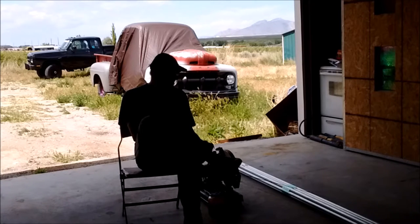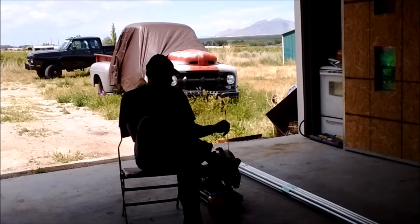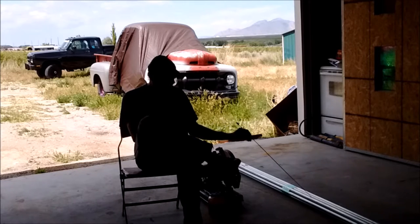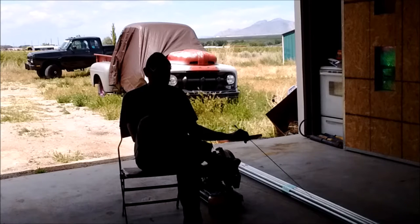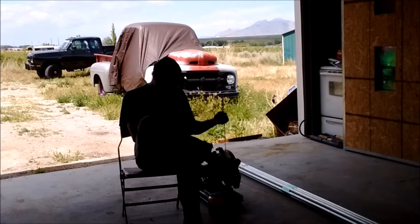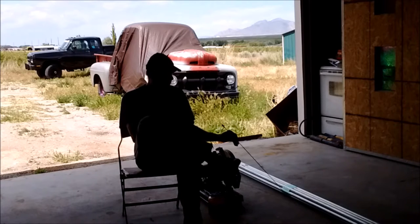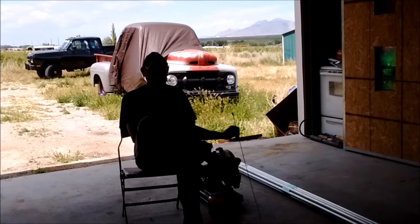We're getting ready to build our rack for the old oven here. This is 1-inch conduit, electric conduit. I paid about $70 for 10 sticks at Home Depot. Now we're going to get ready to cut it all to length on the old chop saw. There's going to be some other stuff, and I'll show you how I'm going to build my rack out of pipe versus angle iron. It's a lot cheaper, and I think it will be a lot better to use.